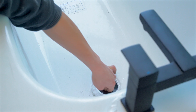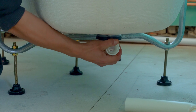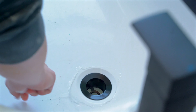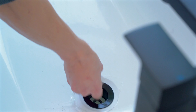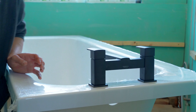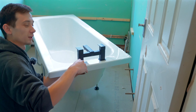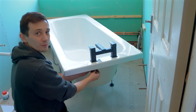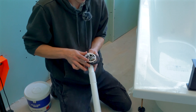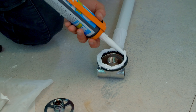It's normally just a kitchen or bathroom tap. Literally open the cupboard of the kitchen unit, go underneath and fully open the isolation valve. Sometimes people buy the incorrect tap for their basin, so they turn the isolation down a bit just to stop the flow so it's not as powerful, because sometimes the wrong style tap hits the sink at the front and splashes straight back up at you. So sometimes it's been shut off a bit - it all depends on what's been supplied.